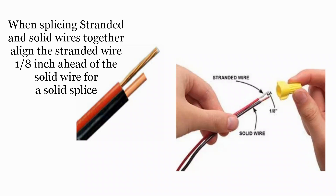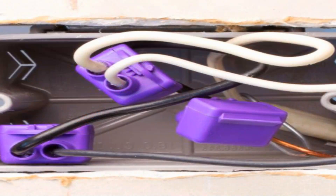This will ensure a tight, solid splice. Now a note about aluminum wiring. While authorized for use, it must be approached with a different understanding of its properties and the things that can go wrong with it. There are wire connectors specifically for aluminum, which have slightly different procedures for splicing. There is a specific requirement for connectors and anti-electrolysis coating for splicing aluminum and copper wires together. Don't ever splice those two together without that — the wires will degrade within the splice, arc, and start a fire.